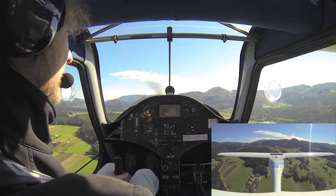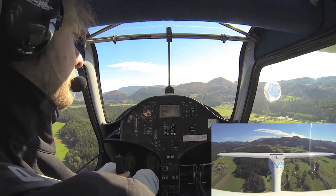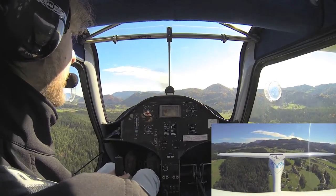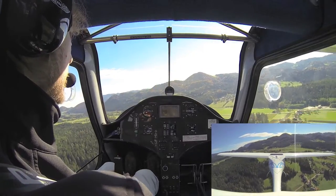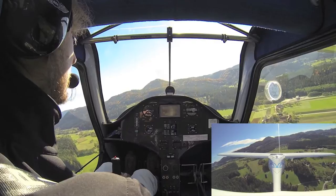When we reach about 120 km/h, we go to flaps one. When we are 45 degrees off the runway, we initiate the third turn — the turn from downwind to base. All the while we should maintain the airspeed above 95 km per hour.